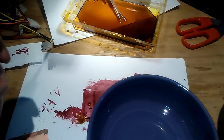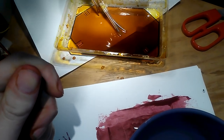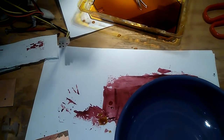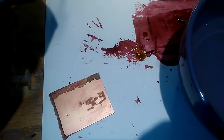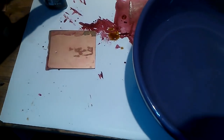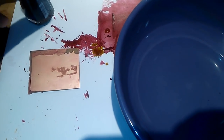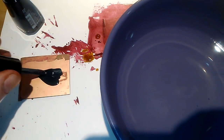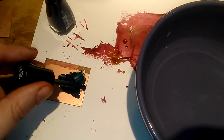The first thing you want to do is you want to paint the PCB — the copper board, it is not a PCB yet. You don't have to be particularly accurate in doing so, you can be a little sloppy. Just a small layer of this stuff will protect the copper.